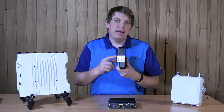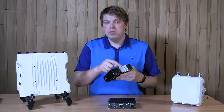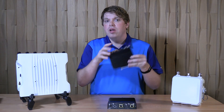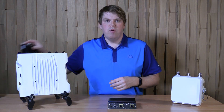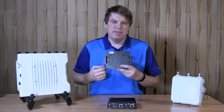When using the DIN rail adapter on the back of the wireless client, you can stand it off the DIN rail in both vertical and horizontal orientations. When mounting the adapter on the bottom, you can mount the wireless client flat against the DIN rail with the ports facing down or facing up. The second mounting option is through the use of mounting ears, which attach to the bottom of the wireless client and can mount it to any flat surface.